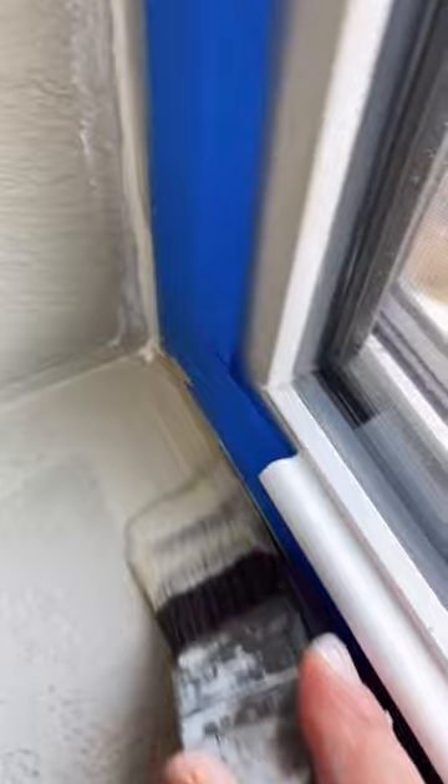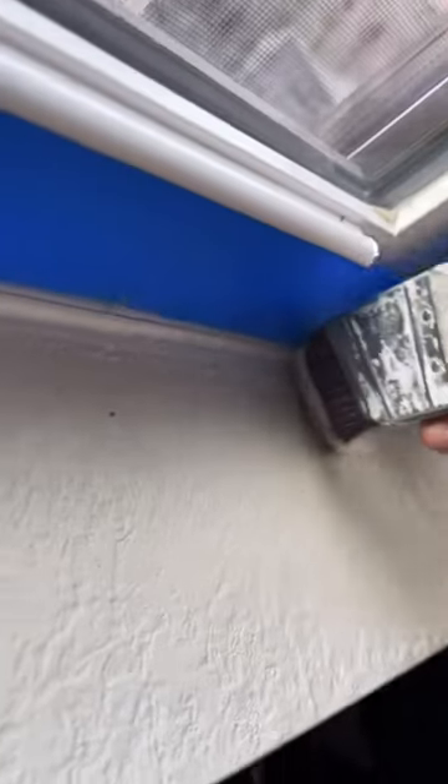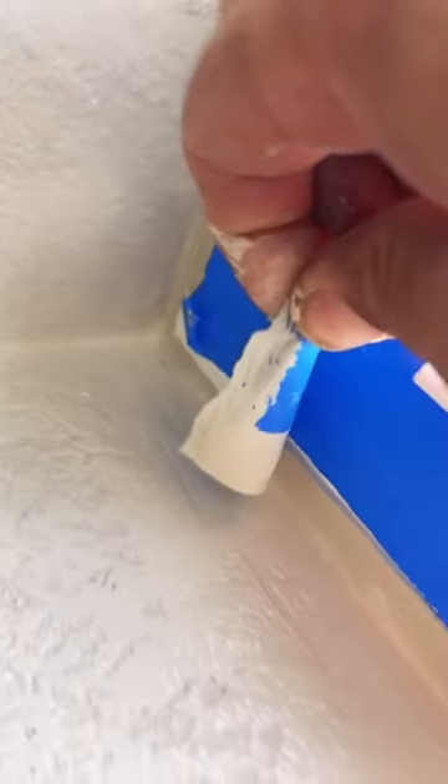I don't want to wait too long because once the caulking dries a hundred percent it kind of gets stuck to the blue tape and then it's just going to be a mess — you're not going to have nice straight lines. So I recommend not waiting too long before painting. Just be super cautious not to pull the caulk out since it's not fully dry. Then look — I'll pull the tape: no bleed through, nice straight lines. Be super careful when pulling the blue tape so you don't pull out that caulking.